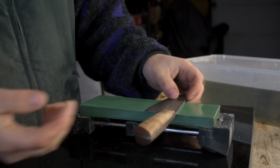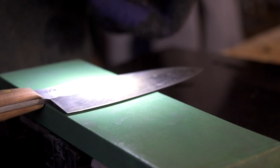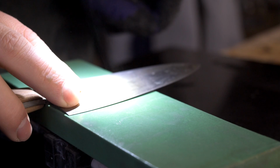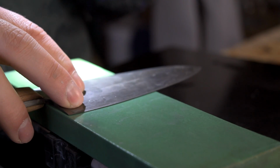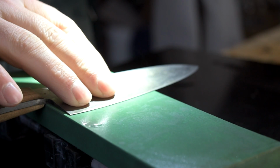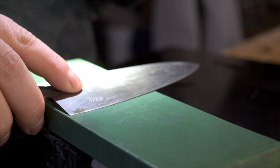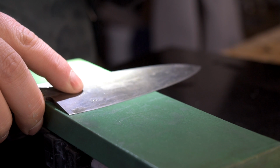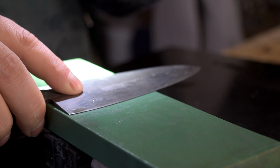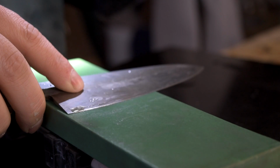So I would do that same thing with my kitchen knife. I'm going to lay it right here. I'll use a flashlight here to exaggerate what I'm talking about, but just under your naked eye, under normal kitchen light, you will be able to see this shadow under the blade. You can see it closing up there. And as I tip this down, you can see I've laid it on this flat bevel here, and it almost disappears. We still have a little touch of black you can see under your edge. But as I tip that blade up, at a certain point, that shadow disappears. You see that? If you're back a little bit, just right there, you can see that hint of shadow appear again. Once you tip it up to a certain point, that shadow's going to disappear, and that's your sharpening angle.